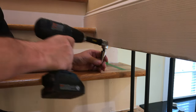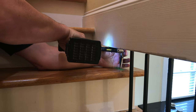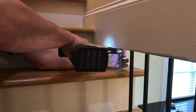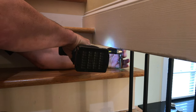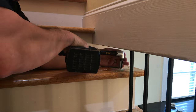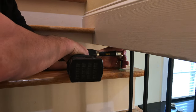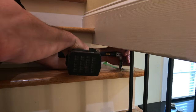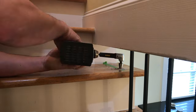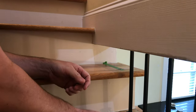I've got my spots marked for where I'm going to drill. I can get in here — it's super tight. I've got it down to the seven-sixteenth mark almost, but I need to go all the way to the five-eighths here on the bottom. I think that's got it, so I'm going to test fit a baluster and make sure I got it down to the right notch on the step bit.